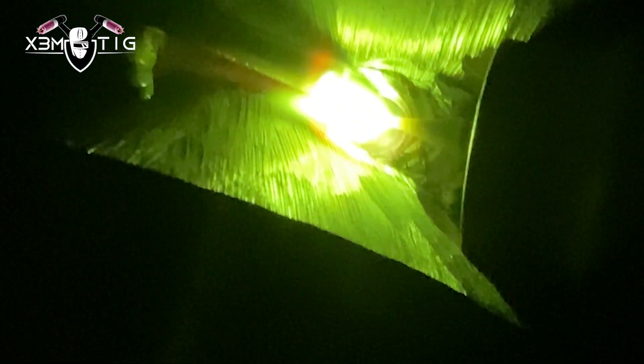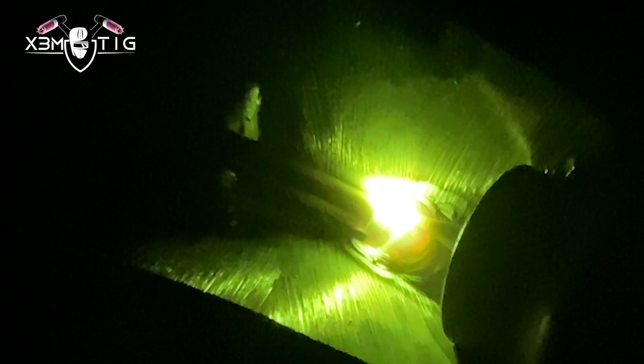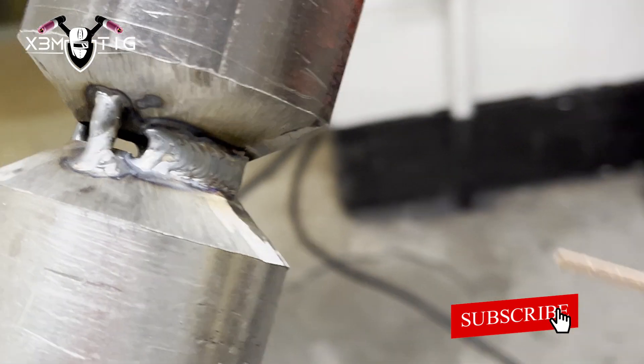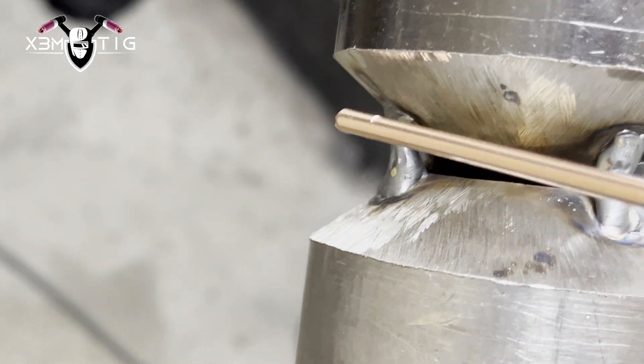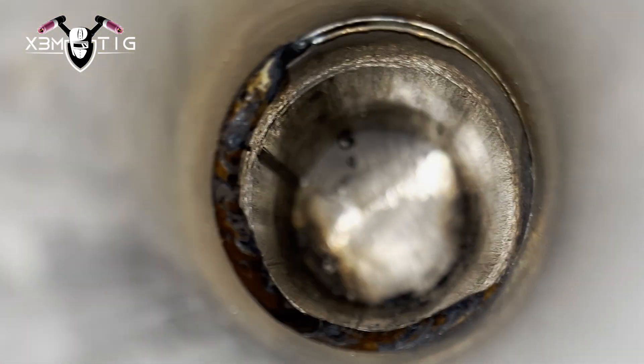I start the dipping technique — as you all know, dipping technique is where you control your puddle and minimize the risk of excessive heat input from your rod. You're going to have a nice uniform consistent root all the way around. I use that on a test and in the field. Always start back-feeding on the bottom and start dipping technique on the top.